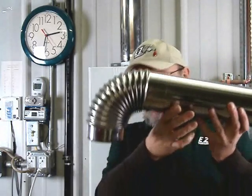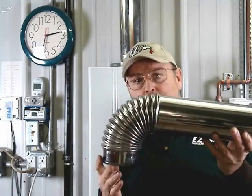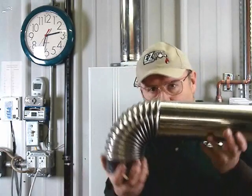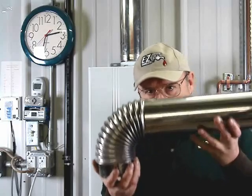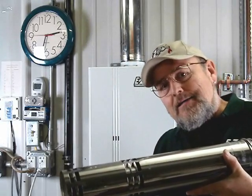About the 94-degree bend — when I hold this up you can see that it actually does slope downhill, and in our other videos we talk about that. The reason you don't force this to be horizontal, and that this has to have a downward slope, is so that condensation drains back out of the pipe and drips off of it. You just can't have condensation running back down inside the heater — it will corrode the internal components and cause premature failure of the unit.